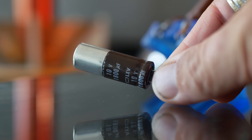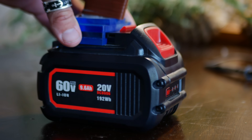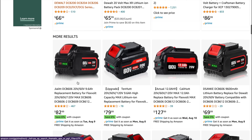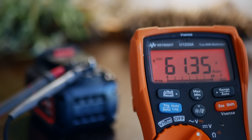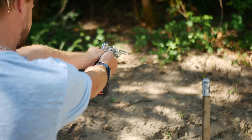The rounds consist of an aluminum projectile glued to the front of a fresh capacitor — it looks really sleek. But let's talk about that drill battery. This was the hardest part of my design and literally racked my brain for a solid week. 90 volts provided the best results, but finding a handheld 90-volt DC power supply that can pump out close to 10 amps when needed — nearly impossible. Luckily my Patreons pointed me in a good direction, and I found a flexible 20-to-60-volt battery designed for drills. I hacked it open at 60 volts — closer to about 62 volts — which was good enough for the first version of this prototype.